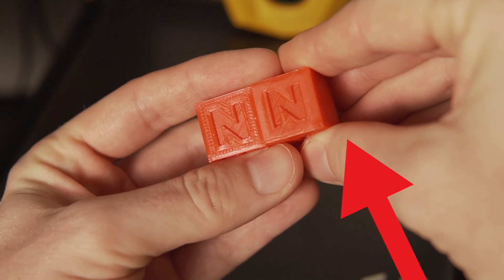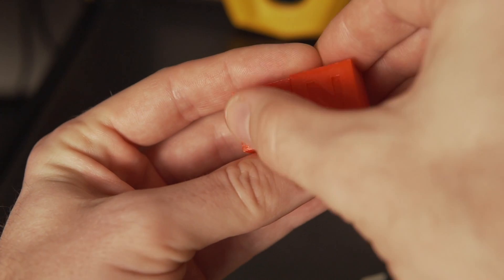With this setting, the printer smooths out the top layer of your printed parts, which can be useful for your own prints or for parts you're selling through a print farm. It's really useful for parts that you want to have a more finished look and you're trying to get rid of some of those layer lines. We'll look at how to activate ironing in Cura, explore the submenu settings, and also examine the effect on print time and Z-axis tolerance.